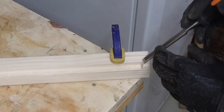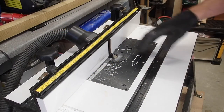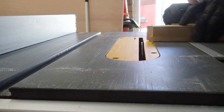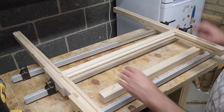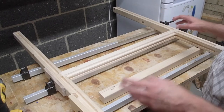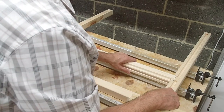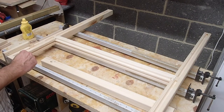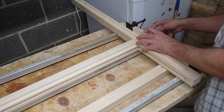And a little bit of chisel work to square up the edges. And for the back middle runner, I have the fence set up to give a 3mm gap. Now it's time to assemble the front. I have the legs set up on a few sash clamps to help keep everything nice and even, and as well to use some compression. On both sides of the sash clamp I just have some scrap, so the metal doesn't go into the wood.